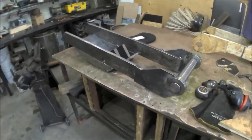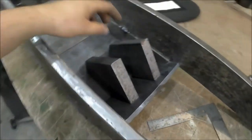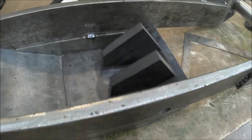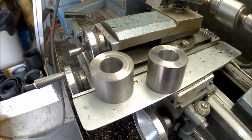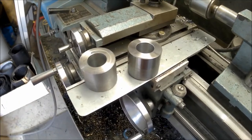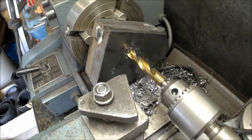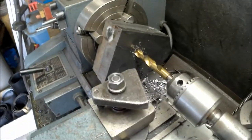This is how far I got done — everything tack welded together, pin made, test fitted. Making the pin took a long time. These are still loose and I'm going to tack weld those in. Right now I'm cutting up some 4140 for four bushings for the bottom and top of the hydraulic cylinders — going to press fit them in. I decided to go with 4140 since I didn't want to use just the one-inch mild steel plate which I figured would be a little soft.